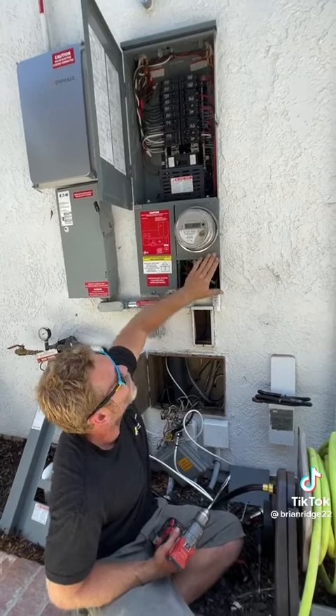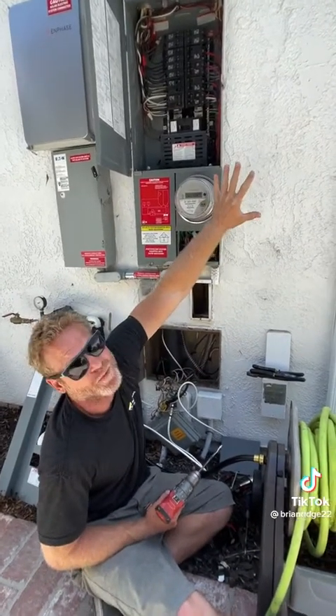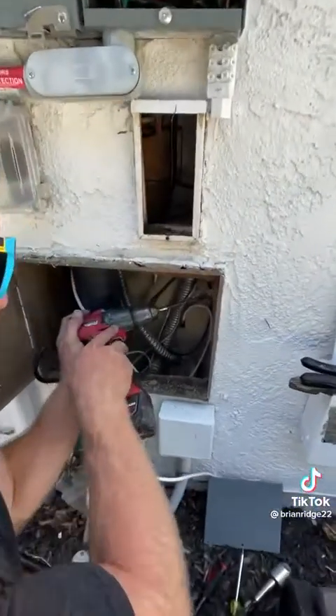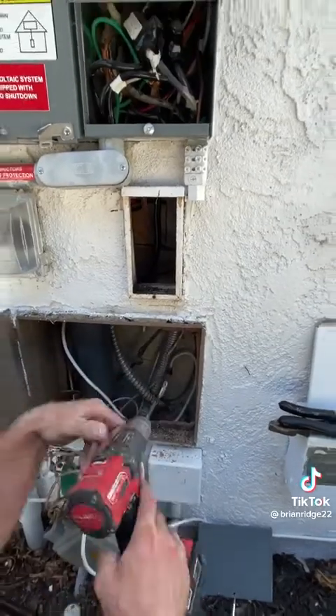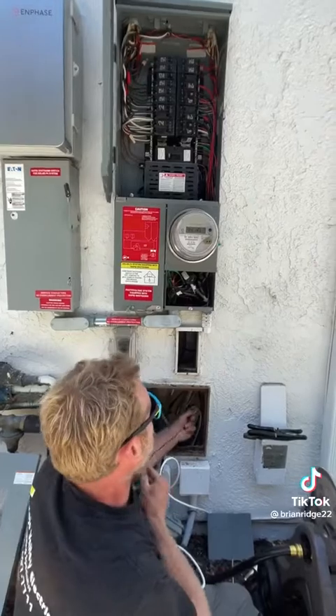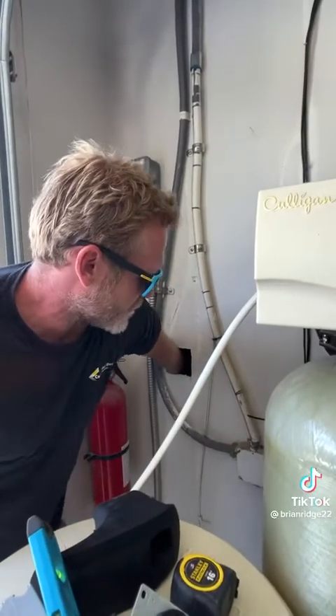But I still need it up to my outlet, so I'm going to drill through this stud here. Now I can snake from the hole that I just drilled up to the outlet hole that I already cut out.